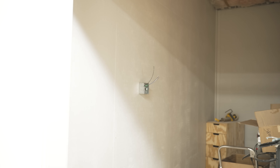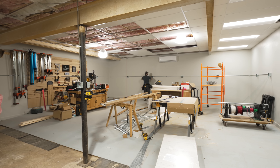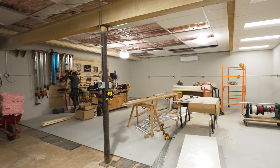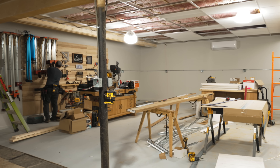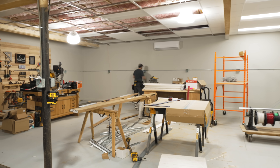Rather than trying to go box by box and pull wire between each one, I pulled wire from the very end of the run to the very beginning of the run — all five wires at once — and then once that was done I just pulled out a little loop at each box to give me enough slack to wire up the outlets. I would highly recommend that method if you're making up a long run of junction boxes like this.